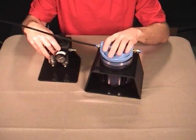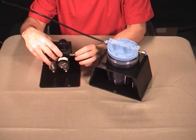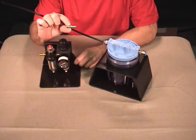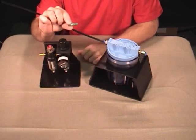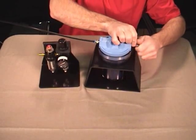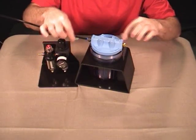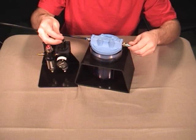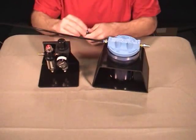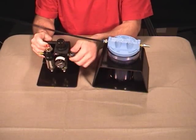We have our desiccant filter here and we have our filter regulator right here. I'm going to take the air quick connect — the little metal quick connect — off of the filter regulator. You'll need a wrench to do that; I only had it finger tight for this demonstration. We're going to take that quick connect fitting off and then take the silver fitting off of the desiccant filter also. Basically all we're doing is taking these two and switching them places — putting the quick connect into the desiccant filter in-port and putting the push-to-connect fitting into the in-port on the filter regulator.